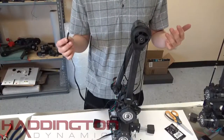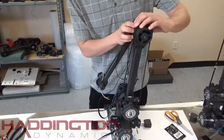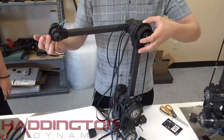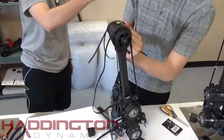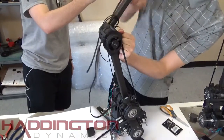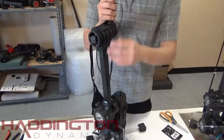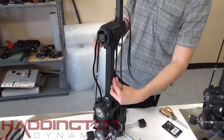After that, take your two 122cm x 9mm GT2 belts and press the teeth into the bottom area of the new belt pulley. Turn the end arm so that the belts go under the strakes and come up the other side. Now hold the end of the belts very tightly in place and turn your end arm backwards, letting the teeth on the belt skip over the pulley. Pull the belt through until the end is in the middle of the pulley and the external gear when the end arm is completely vertical.